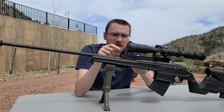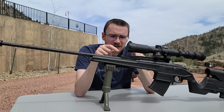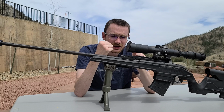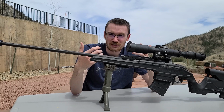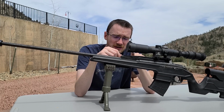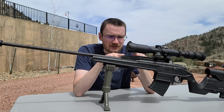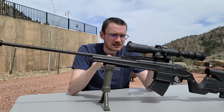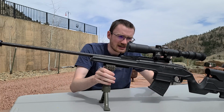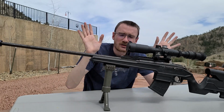And one screw. Now this one's nice because it's a Torx head, so it's really easy to get a nice firm fit on this, unlike the original Mosin screws, which are flat heads, or even Allen heads. I quite like Torx, so I'm glad they went with that. They didn't cheap out on this mount, folks. And it's Loctited down into that base, and as you can see, this is rock steady. So the whole base actually makes contact back here on the receiver, but there's no drilling required.